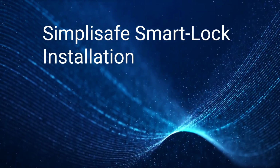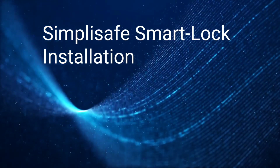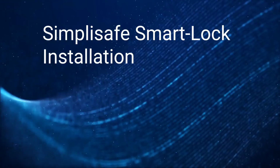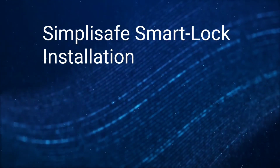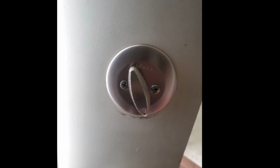Today I'm going to run you through how to install the Simplisafe Smart Lock, the physical installation, and using the keypad to add it to your system. So the first thing you're going to need to do is find your lock. It's right there on the door. We're going to replace the deadbolt piece, just the inside deadbolt piece. This is the only piece that the Simplisafe lock replaces.